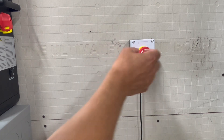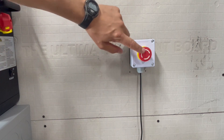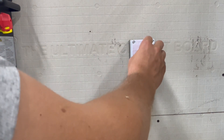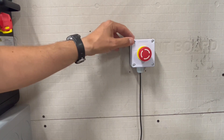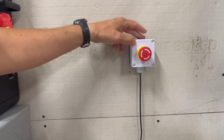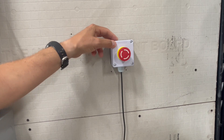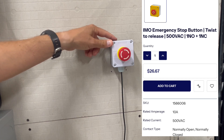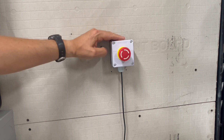So that's sort of frustrating. Normally you'd want the switch sitting in one position and then flip it to trip the relay, but with this switch on is off and off is on. I felt dumb after wiring it up. The switches don't cost a lot and only take a minute to wire in, but if you're going to buy one of these switches make sure it lists both normally closed and normally open options. This one didn't even have that on the listing, which should have been a sign.